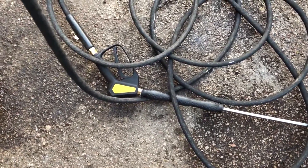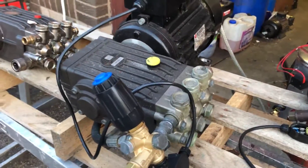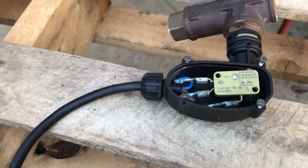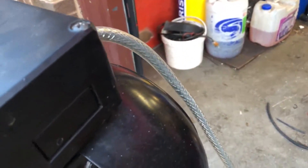It's running — I've got a gun on here as well to show, but that gun is closed. What's happening is you'll see the machine bounce; that pressure switch is doing the same — jumping, starting, jumping, starting — it can't cope with it.